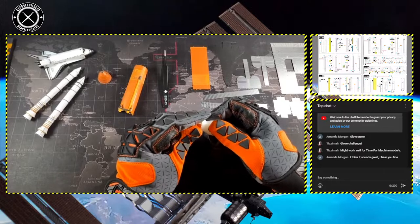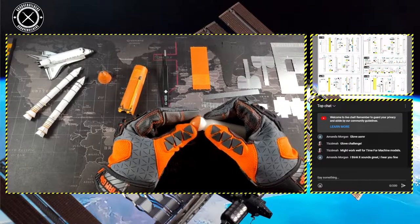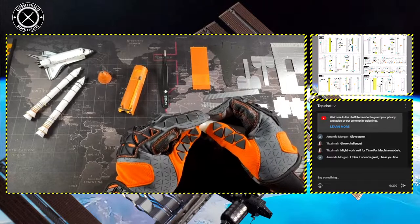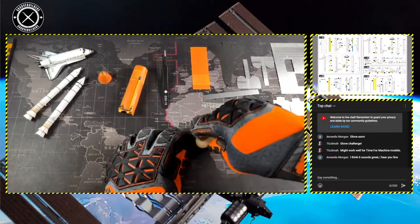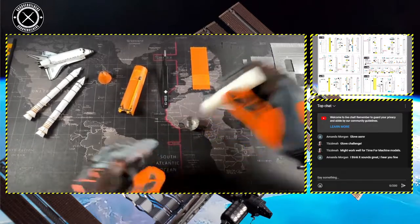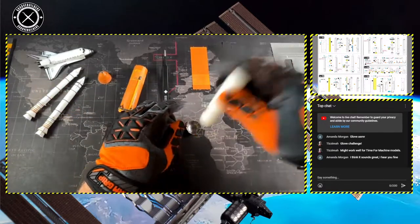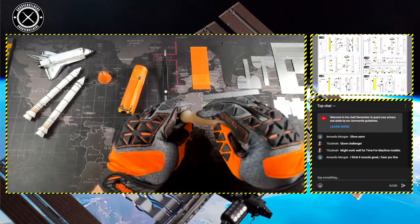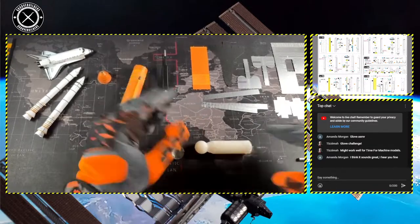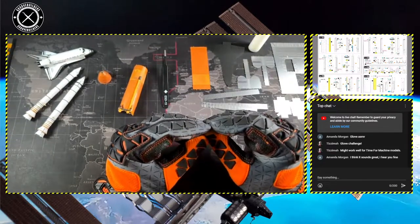I actually would love to know, there's some builders out there that have these blocks that come with a dapping set. I've been looking at getting one for a long time. I'm curious to know how well they work. For nothing more than the fact that, to be totally honest, if I had a little thing like this and I pressed it into it, that would make a really nice shape almost instantly. The problem you run into when you have those blocks is if you press too hard, you will actually lose the detail that's on the part, especially edge detail. That's because you're flattening that metal that's been essentially engraved again. Just keep that in mind when you're using those tools.